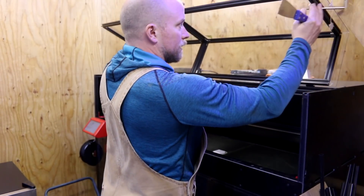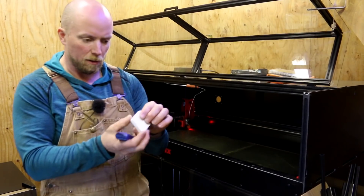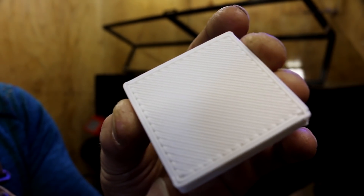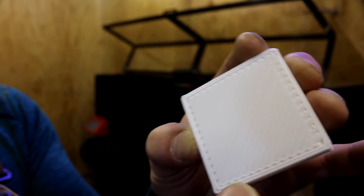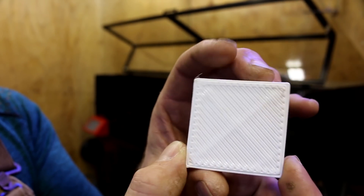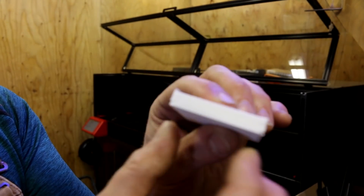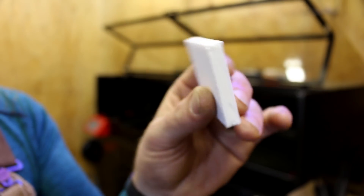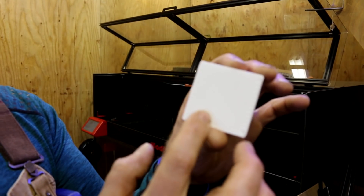Test case number five — which is really like eight. The perimeter popped off really easy and that popped off very nice with no damage. Now the only thing I have a problem with: those lines all look nice, nothing wrong, very symmetrical. But there's a little gap in between them, and that's a problem — and gaps on the edge too. I can play with the bottom layer a little bit. The top looks like it needs more layers as well, and it's settled down there — that's because of the fill. There's a lack of fill in there; it's basically empty inside. Aesthetically I'm not a huge fan of those lines. This bottom part is the part that really needs to be cleaned up — it all needs to be filled in. So let's do this test again and change the quantity of the bottom layers.